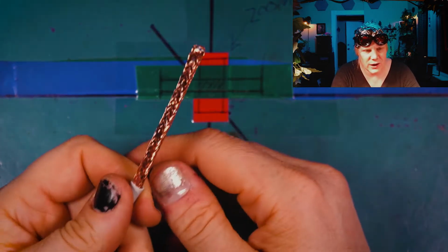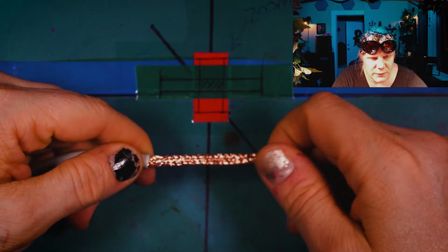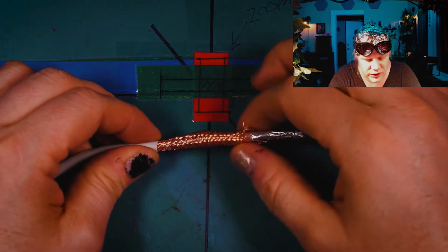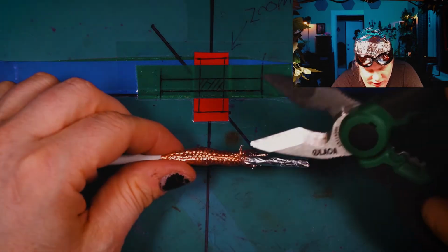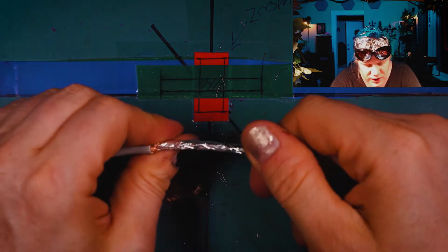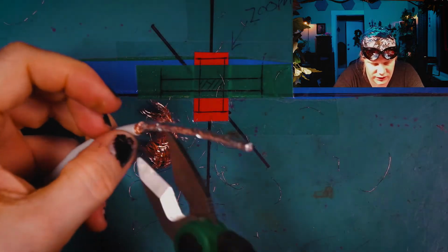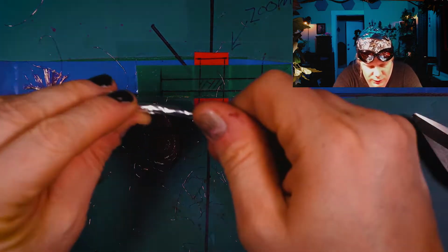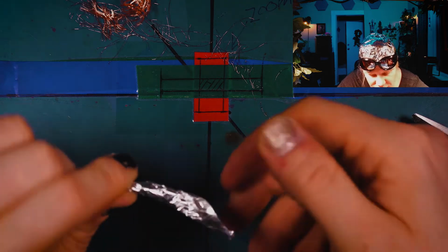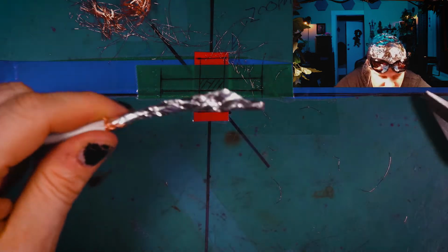So here's the first thing, we've got our braided cabling here. So this is the braided jacket, okay? And we see this in cable like the Ubiquiti Tough Cable, which is the cable that I specifically use for doing towers because it's cost effective and it's built like this, okay? So we just took off the first layer, which is all this braid. So now we've got a foil. This is like an inception of cabling. I have a feeling this is very light gauge. Okay, let's see here.